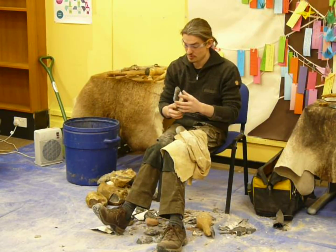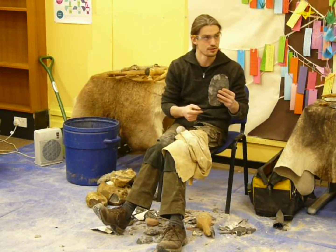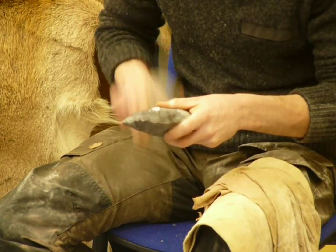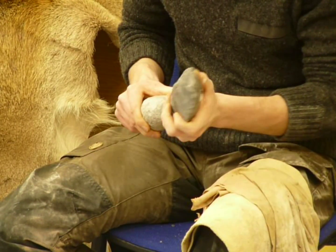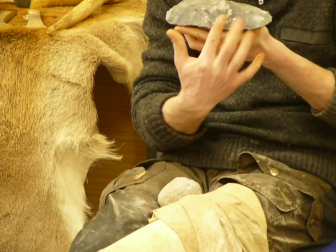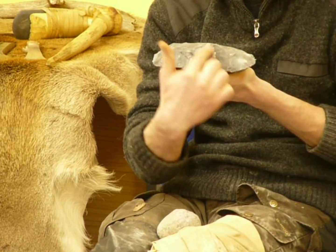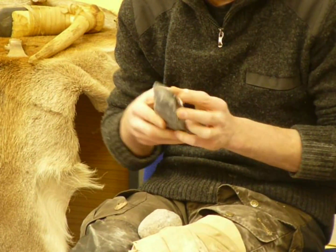It's nice and thick and you'd probably grind off maybe about a centimetre off the sides, which would be a big investment of time. So I've taken out a bit of material on that side. It's already dipped on that side, so I've isolated this thick area over the surface. That should encourage the shock to stay in this area rather than go anywhere else — I've given myself the best chance of undercutting this.